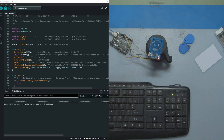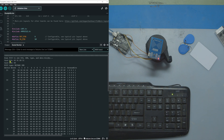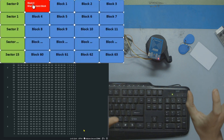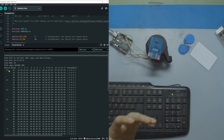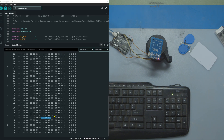Opening the serial monitor — we scan the card to see data blocks. Taking what I think is the compatible Mifare card and placing it on the reader: first thing is the unique identification number, these eight numbers. Then we have the SAK, and then our type — Mifare one kilobyte — so we know this card can store information. Here is our data block dump: the card is separated into a bunch of different data blocks. Going to the bottom we can see block 00, 01, 02, 03 all the way up to 15, 63 with no important information written yet.